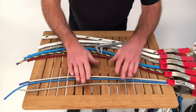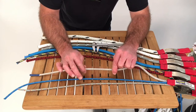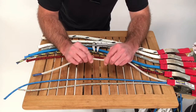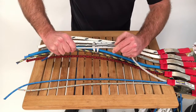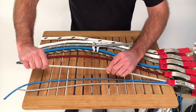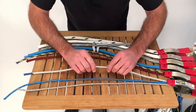All right. A couple more lines on the new 12 strand. This is a single braid. This is Dyneema. It's coated. Sometimes you get this stuff and it's rock hard. It won't even fall because the coating's so thick. And that means that it's been kind of glued in its kind of pre-stretch, preset construction mode. And you're not going to have to milk this out much.